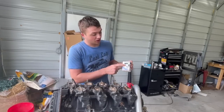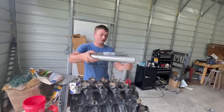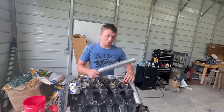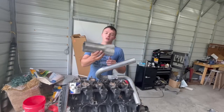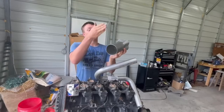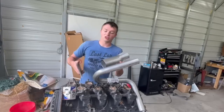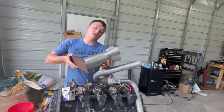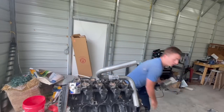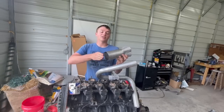We got this two-inch hole saw, then we ordered two-inch exhaust pipe. We're going to cut this to the right angles and it'll come up and curve out. We're going to have two throttle bodies going to each collector - just like your exhaust, four tubes per collector. We'll cut this, put a plate, drill a hole in it so it'll be a mounting surface for a throttle body, and then connect the throttle bodies together with a shaft so they operate exactly together.